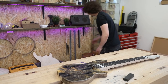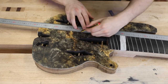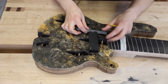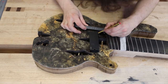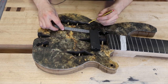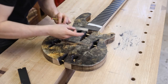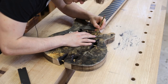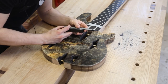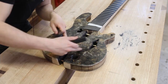So firstly, let's get the ruler. I'm going to extend these necklines down very faintly with a pencil. To miss that little high one it should be around 40 millimeters down from the end. So one there, one there. And if I remember correctly, the next one is 40 millimeters back from that. It's gonna miss that crack entirely so I do not need to put a back cover on it, which is good. Let's convert those two markings to lines.